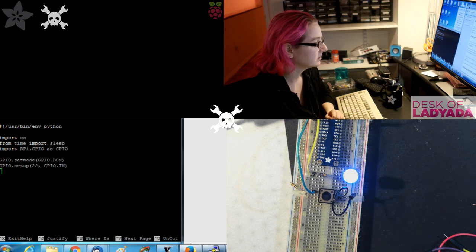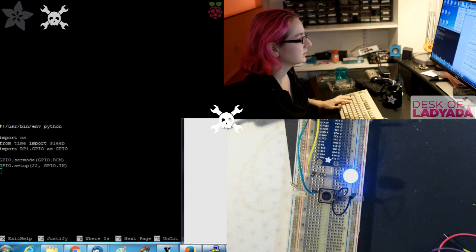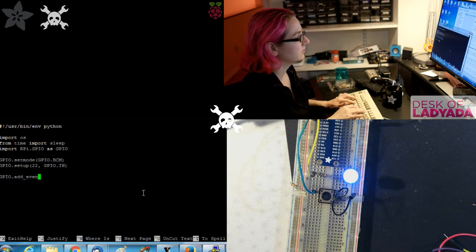So channel. I don't know what channel is though. So, oh, that's the pin number. Okay, so wait for edge. No, I want to event. Okay, so I can run GPIO add event detect 22 GPIO falling.